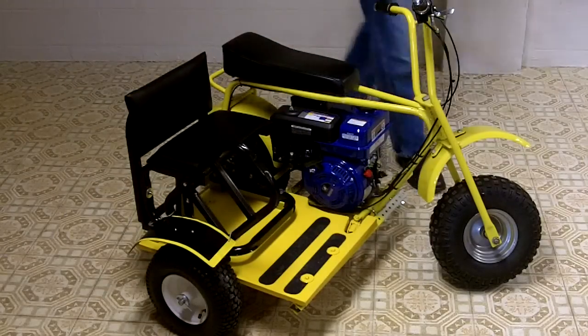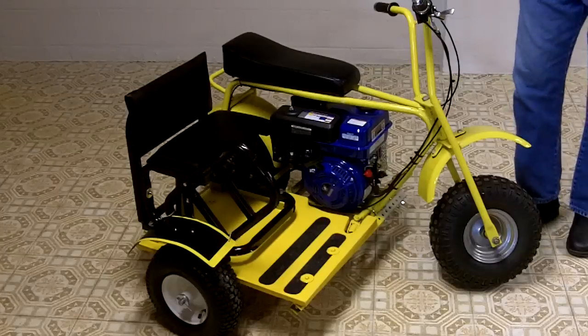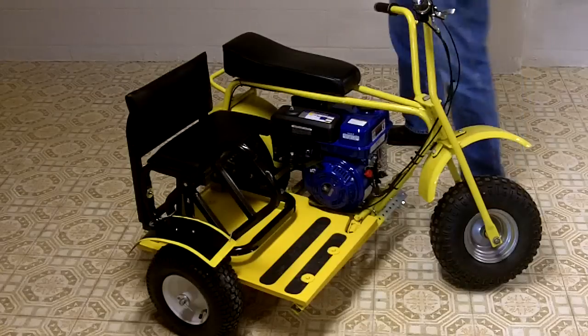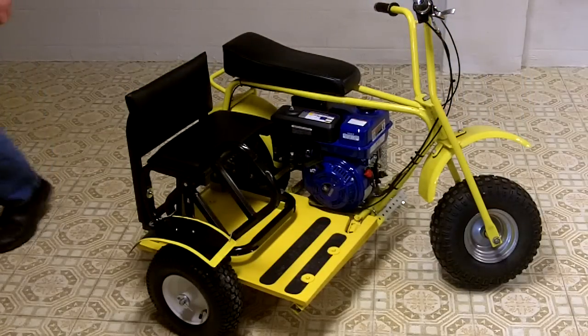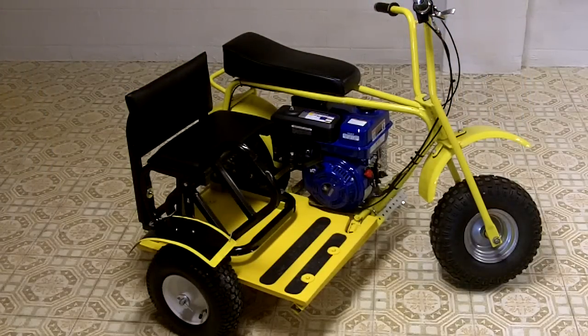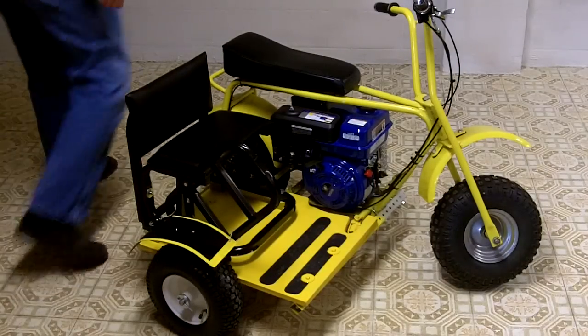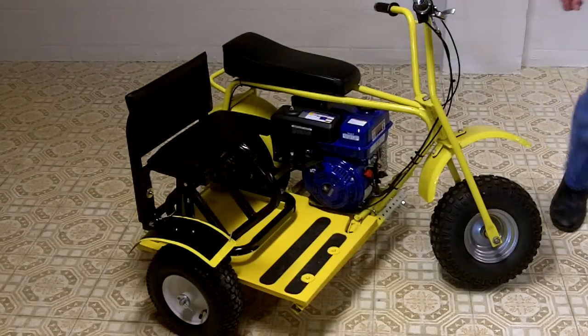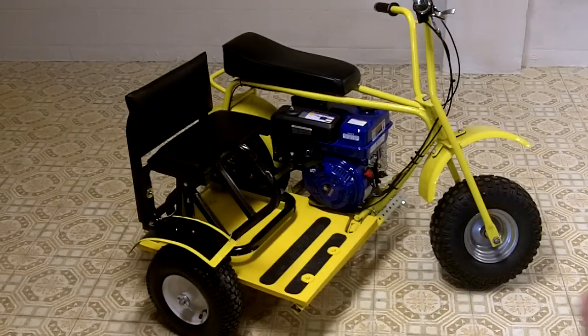On the bottom, as I showed you, there's square drilled one-quarter inch stock. The drilled portion makes it easier so you can just go ahead and bolt the bolts where you want to. I attached it to the mini bike via u-bolts — they might not look too strong but they're extremely strong. If you look at trailers at any outlet, especially Harbor Freight, they also use u-bolts to attach wheels to the frame.